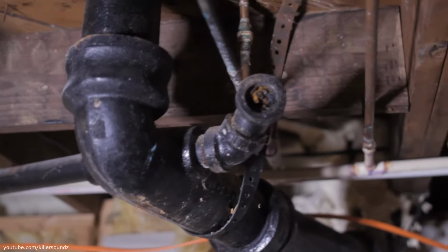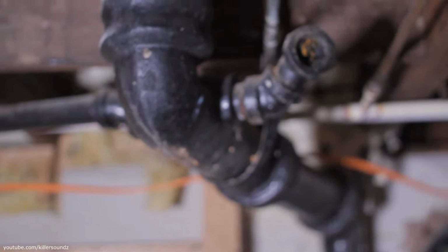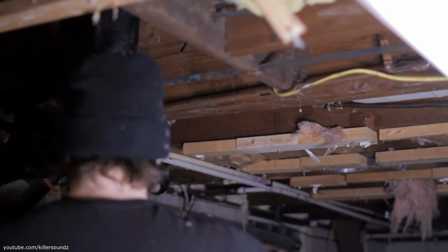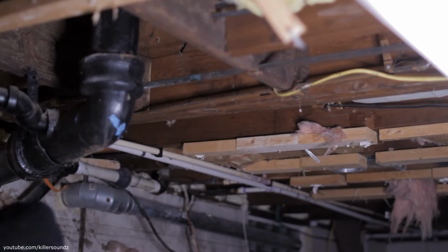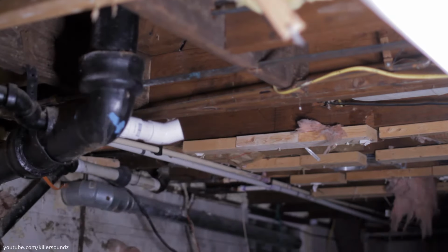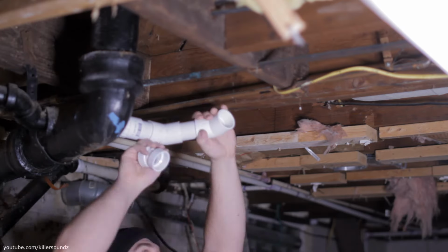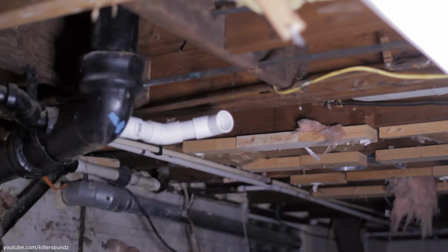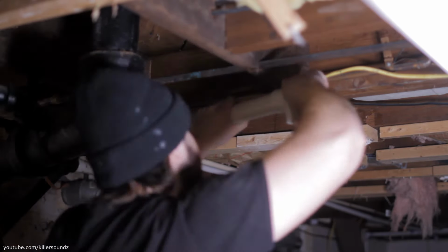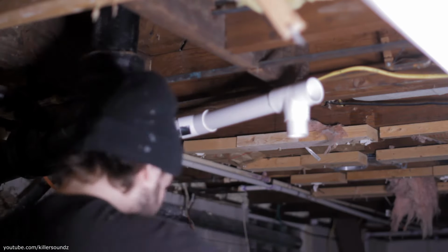So, you know, as far as the drain snake itself, for the 13 bucks it costs at Harbor Freight, for most of your drain issues, yeah, I'm pretty sure it will help you out and clear them out. But unfortunately here I had to replace this whole deal. And there are limitations to this drain snake. Obviously you're not going to be able to use it on anything bigger than 1.5 inch drain pipe. So if you're trying to snake out a main drain, you know, 6, 8 inch, whatever, 4 inch even size pipe, it's not going to do anything because it's just too small. You're not going to really get it in there.